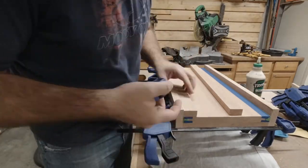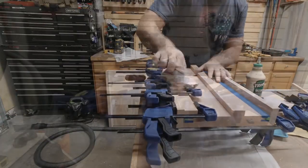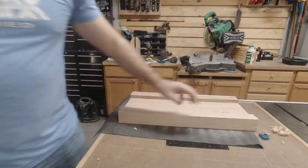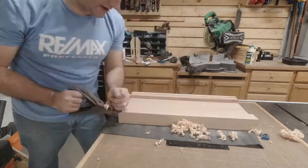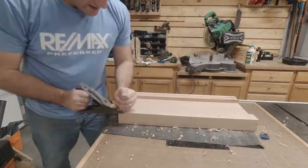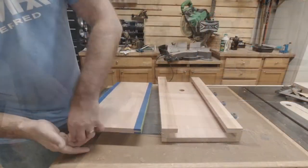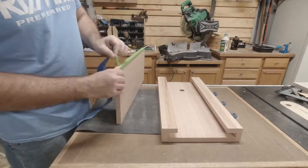The board with the tape on it is in there being used as a spacer, so that it spaces this board out perfectly. After it dries, remove all the clamps and use a hand planer to plane it down flush. I cut these intentionally wide so I could do this and get a perfect fit instead of guessing and ending up with a lip to deal with. Just plane it down smooth and finish it off with a card scraper. I did the same to the back side to make sure it's flush too. I also drilled a hole in that back piece — you'll see what that's used for shortly.